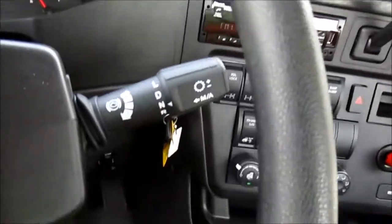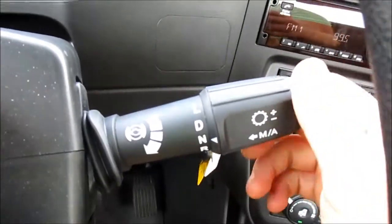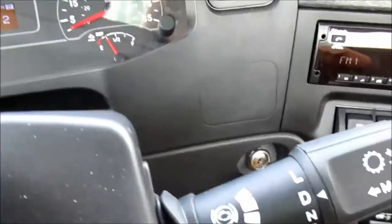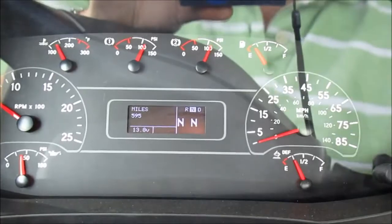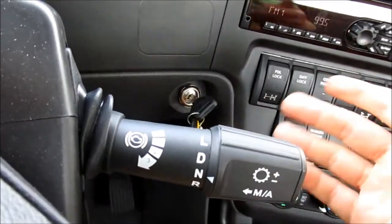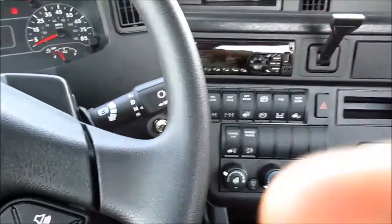And for the automated shifting, this has an Eaton automated transmission in it. When we want to go in drive, you hold the brake and you go into drive. Back to neutral. It's that easy. This is also your engine brake. So here are 1, 2, and 3 settings for your engine brake. It is very easy. So when you're driving and you think you need your engine brake, just set it to whatever you need.